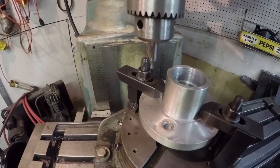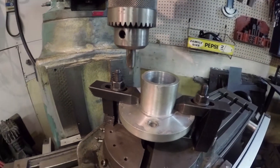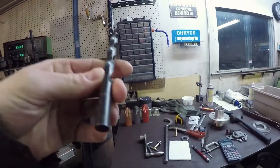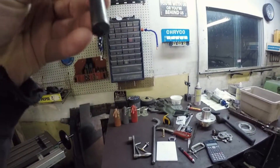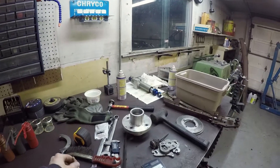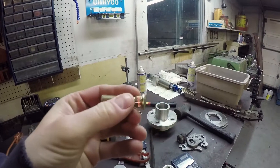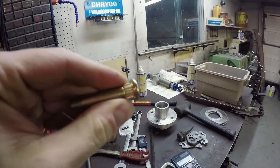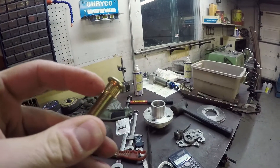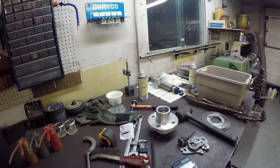The first thing I'm going to do is drill some holes with my center drill, and then after that I'll come in with this drill bit here — this is a 13/32. And then there's the new wheel studs that I need to press in. 13/32 is a pretty good size; that'll give it enough meat so that those splines will bite into the aluminum and stay in there. Okay, let's get machining.